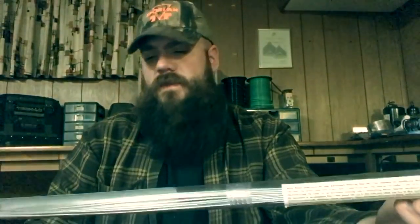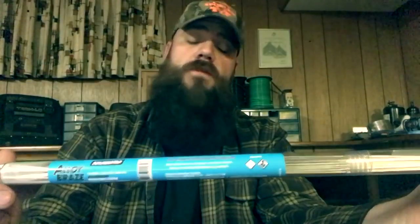What's up YouTube! I've got a nice little demo for you today — doing some aluminum repair with the aluminum brazing rods from Solderweld. If you remember, Solderweld was one of the demos I watched at the AHR conference a few weeks ago. They have a whole lineup of products designed specifically for aluminum repair. Two of the products I received were the Alloy Braze aluminum brazing rods — it's a flux-core rod, which means the flux is built into the rod itself, so you don't need to apply any pastes or anything beforehand.